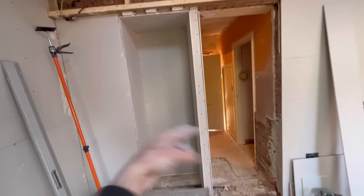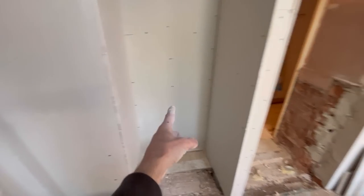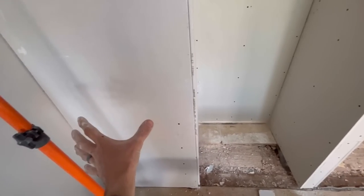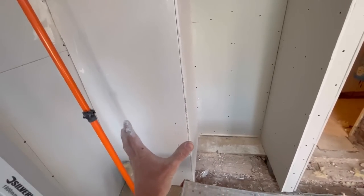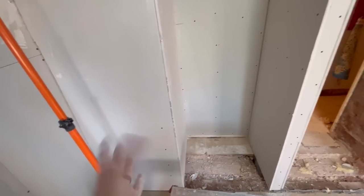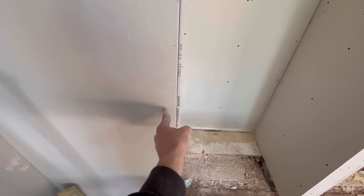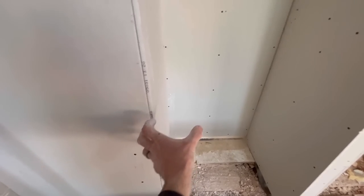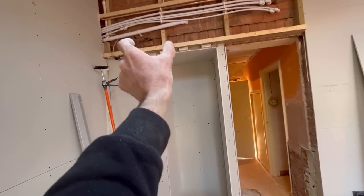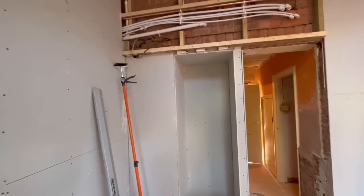That's 600mm deep, 650mm wide. I'm 600mm to this corner. So if I put my cupboard tight to this, that'll give me my 50mm corner there off this unit, because units are actually 570. It's worked up at 600 or 620, 610, depending where you get them from. So 570 is going to bring me about there now. So I'll be able to put a lovely corner in there because they're both tall housing. So I'll be able to cut some panel, whatever we have, to form a lovely corner there to finish that off.